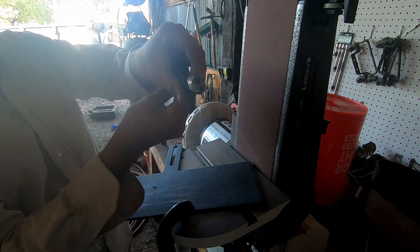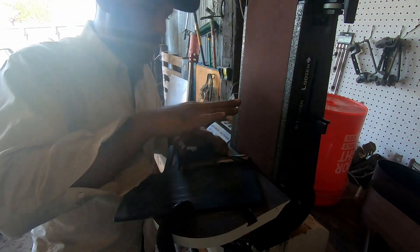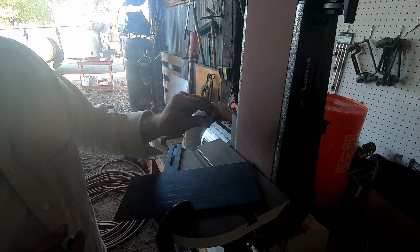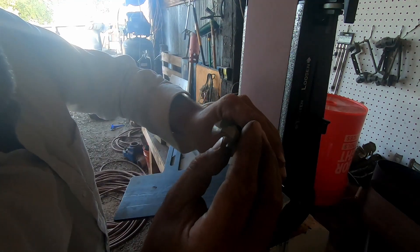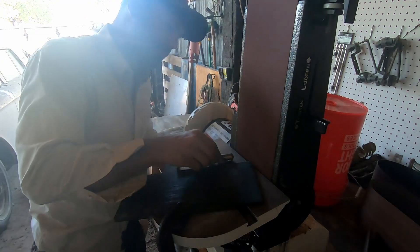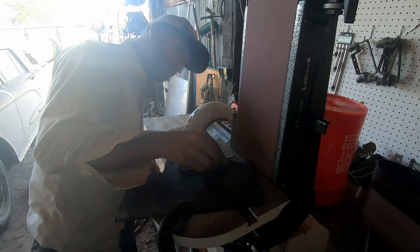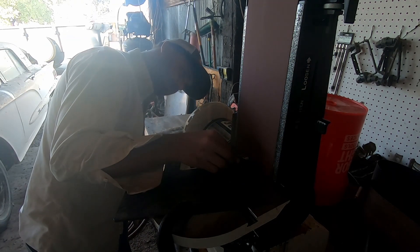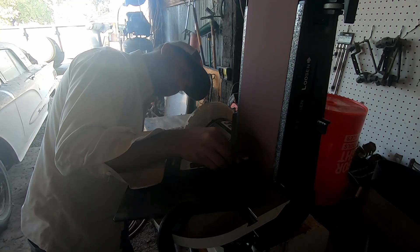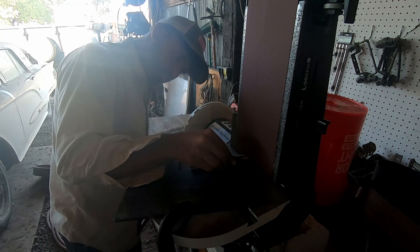With the splines I'm not sure how to do this angle except for putting it up against there completely flat and trying to match it on both sides. When you're sanding one side you want to do it evenly on the other side, because you still want the center of the bit to be in the exact center. You could measure it with a caliper or just eyeball it — I typically eyeball it and you can get it close enough. As you can see, this bit is pretty dull, has some chips, and is rusty from working near salt water, but we're going to sharpen it and see how it does cutting through mild steel. I sharpen a little bit on one side, then flip the bit to the other side and sharpen that side, constantly rotating. It makes it a whole lot easier to make sure that chisel is dead in the center and that you don't cut off too much from one side.